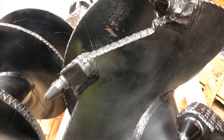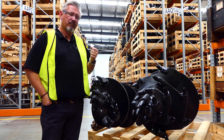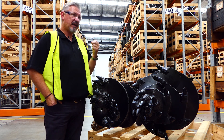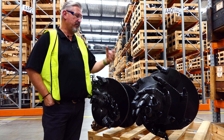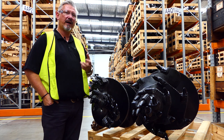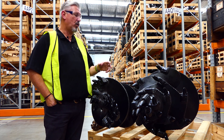The way these work, as we've explained previously, is a point of attack. This point has to reach a down pressure load to burst that material out. If your machine hasn't got enough down pressure to burst that material — that rock — then these augers just become grinding augers. They will just wear away at that rock, and you're going to see a lot of wear on your auger.